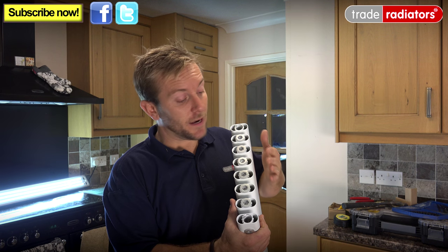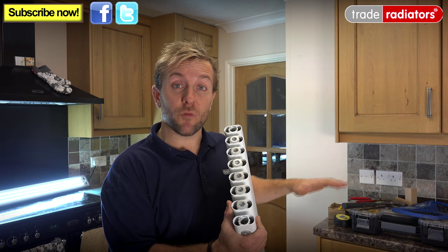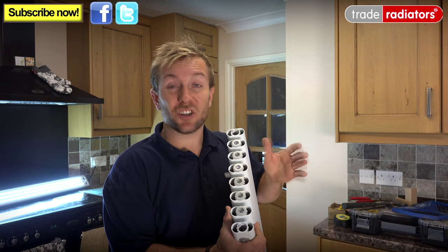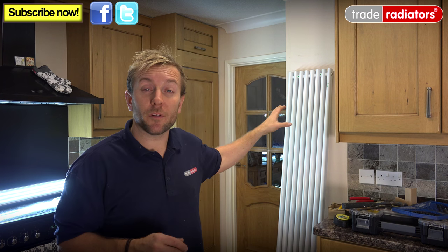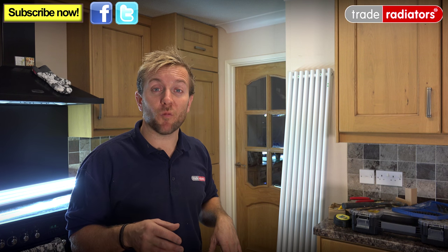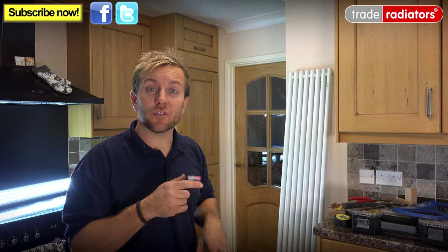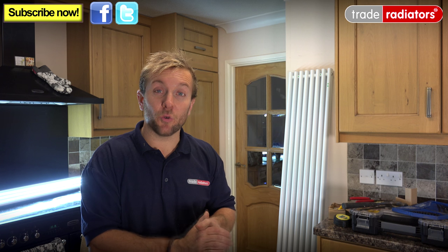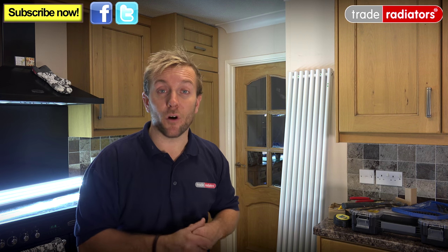Now I'm going to get this ready to hang on the wall. We'll put both stubs in, drill our two holes through the wall evenly, then move on to piping the radiator up. It's worth noting that there are stickers on the bottom and top of the radiator denoting where hot water comes in — it's very important you do this the right way round because column radiators have a small diverter in them so heat is evenly distributed around the whole vertical radiator. Make sure you know which side your flow is coming from before you pipe it up.